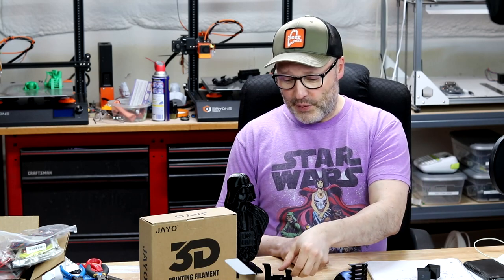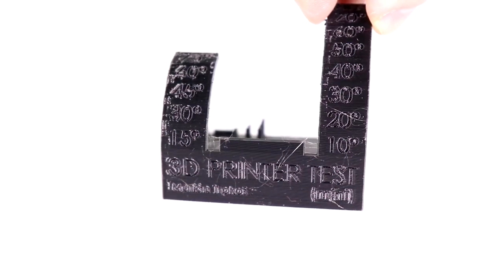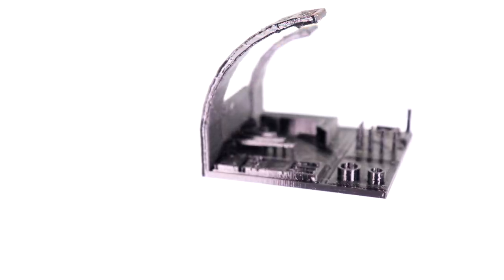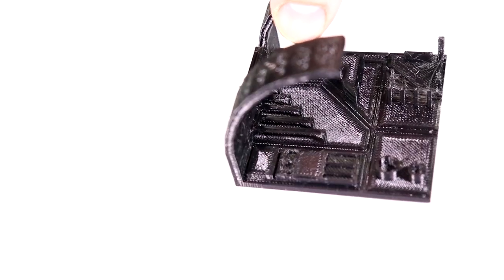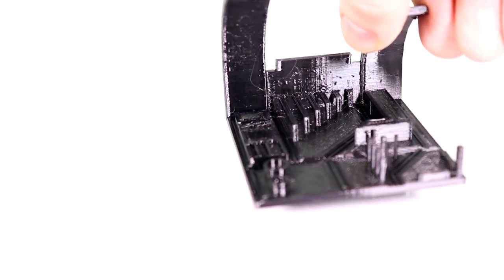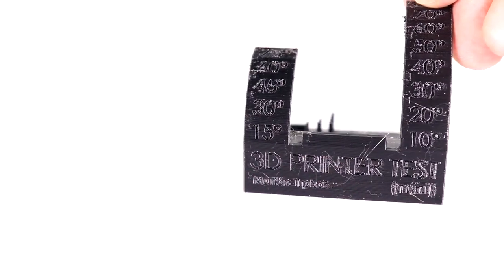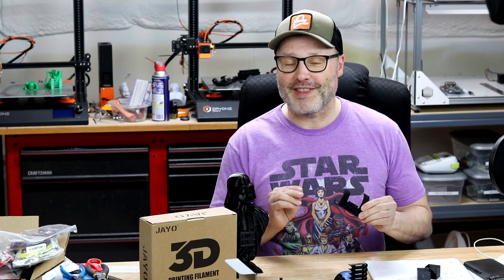I'm hoping you're enjoying my makeshift light box — I had to really tweak the settings on my digital camera because black is so difficult to photograph. Once the extrusion multiplier was dialed in, I did the 3D printer test and it came out very nicely with very minimal stringing. I really expected stringing to be a bigger issue since PETG and stringing go hand in hand, but as you can see the bridging and everything else performed well. There was a little stringing, but not enough to bother post-processing.